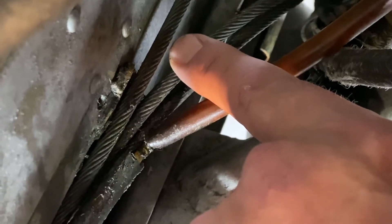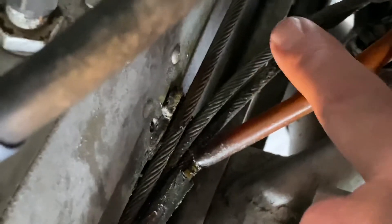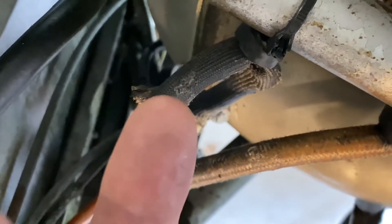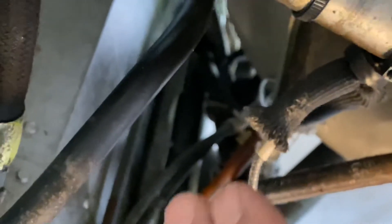As you can see, that's one cable — a standard-looking cable. You have mixture, throttle, and prop, and we're replacing the throttle. The swage fitting up where it connects to the white pipe is coming loose, and there's free play in the throttle cable to the point where it could come apart. So I went and got a replacement — Crockett Leasing bought a replacement.